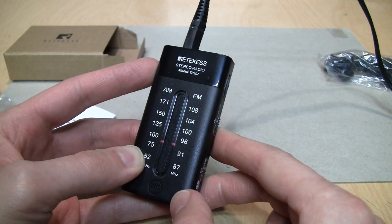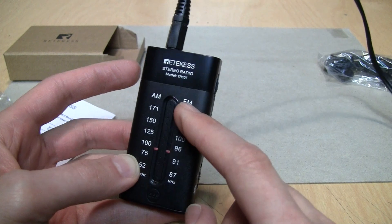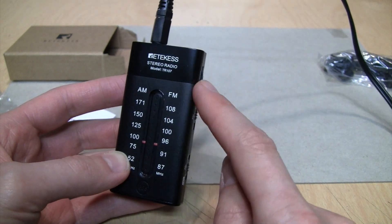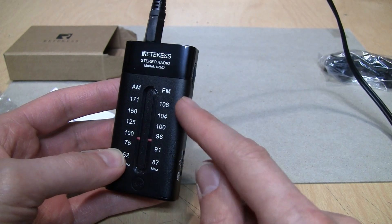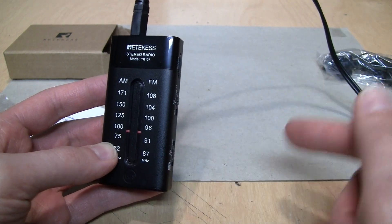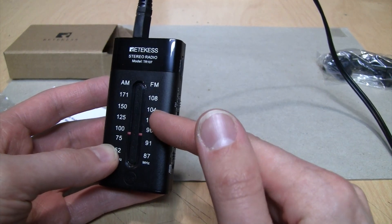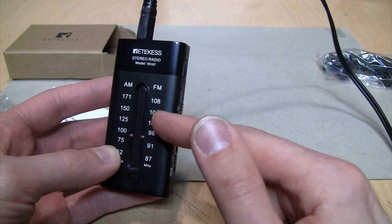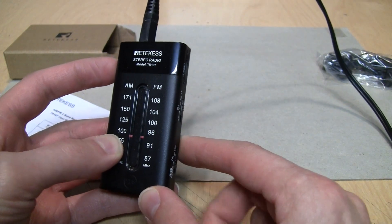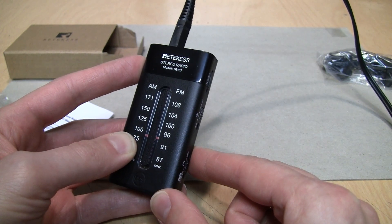It has actually very good reception on FM and very good sound quality. You get that choppiness when tuning because of the DSP chip — what it's doing is periodically polling the resistance value of the potentiometer the tuning dial is attached to, and whatever resistance value it reads it tunes to the corresponding frequency. The refresh rate of that polling is not instantaneous, which is why you get that choppiness as it realizes you've changed the resistance and retunes itself to whatever frequency you dialed in.